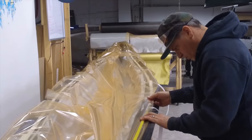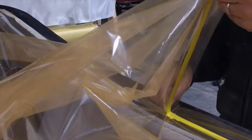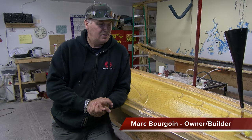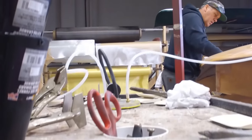After we got the spiral wrap done, we put the bag on. The bag essentially allows us to get a good seal, so then we put it under vacuum. There's equal pressure throughout the boat, and most of the air, if not all the air, has been evacuated.